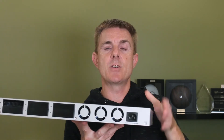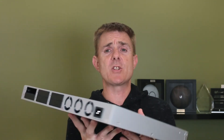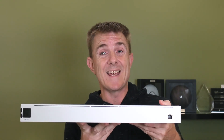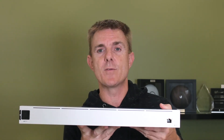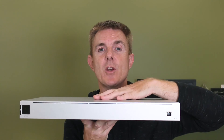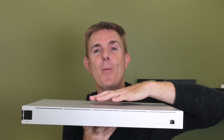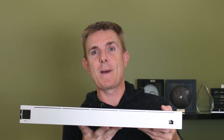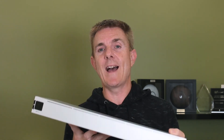The connected device — whether a switch or the UDM Pro — won't turn off; it will continue running. This unit has 950 watts of capable power, so you need to be aware that it has six slots on the back and can power six units. But if you've got the USW Pro 48 PoE, that's around 750 watts already, so you need to be careful about what devices you connect to make sure there is enough residual power if all of them were to lose power at the same time.